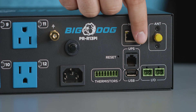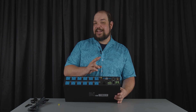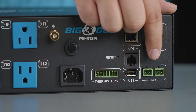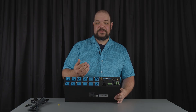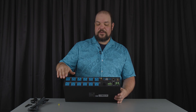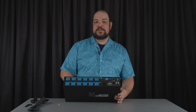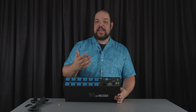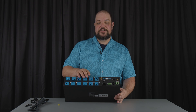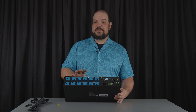From there we have the UPS link as well. Below that we have another 5 volt 2.4 amp USB power supply. And next to that we have some I/O. The great thing about the I/O is it will allow us to control any of these outlets through a pre-configured button press — when it senses a closure it's programmed just like the power button on the front of the unit. It can reset all of the outlets, power on, power off, reset a specific outlet or a series of outlets — it's entirely up to you for programming. From there we have our relay output, which works great through the self-healing functions: if something needs to be self-healed, we can trigger a relay to tell something else somewhere else that something has happened.